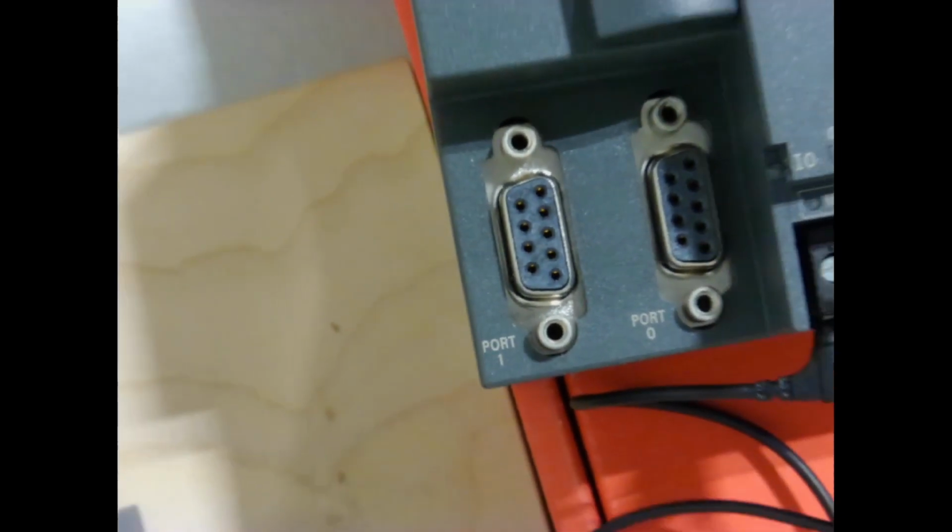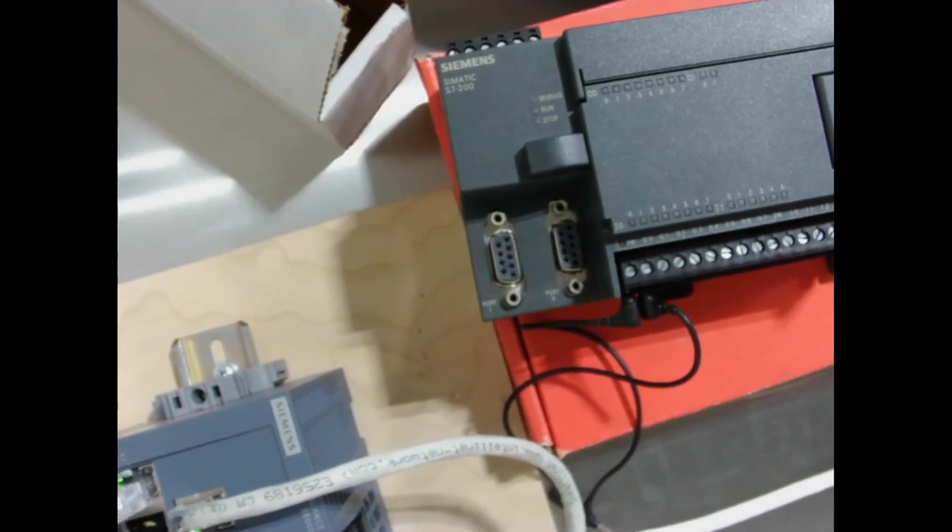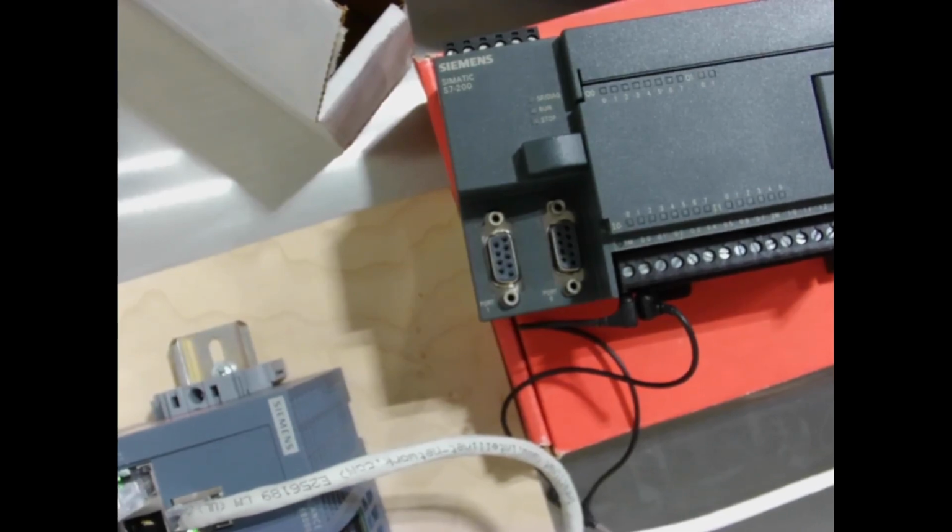It is just an RS-485 interface with some specialty stuff going on. This is using, of the OSI layers, layer 7, which is the application, and layer 2, which is our data link, which we're going to be connected through a fieldbus data link. This combines master-slave and token passing, which is kind of weird.